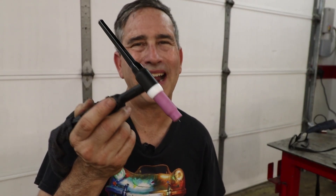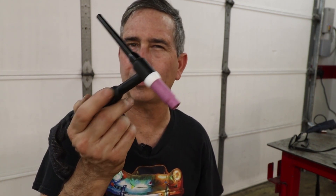If it's on a vertical seam where gravity won't help, you just have to tape it in and burn it — hopefully get a tack down and then go back over it with low current and low travel speed. Every time I push the trigger my tungsten moves, and this trigger has a pretty strong spring — it moves at least an eighth of an inch, which can get you off center. It takes more practice, but I like that it's kind of on-off. The quicker you let go, the quicker it releases the energy — just tapping it like that. This method can get you nice tacks that you can go back over.